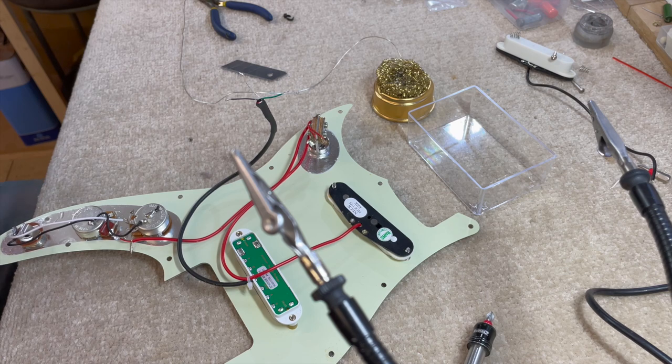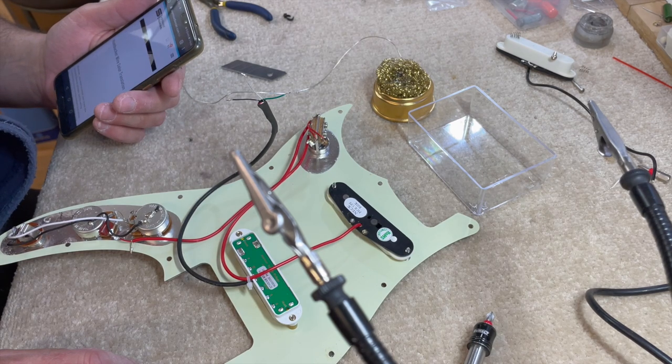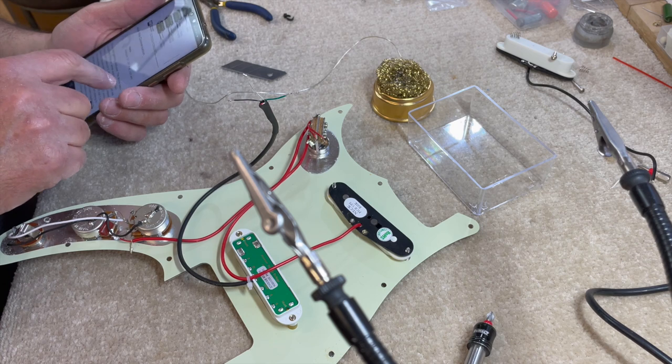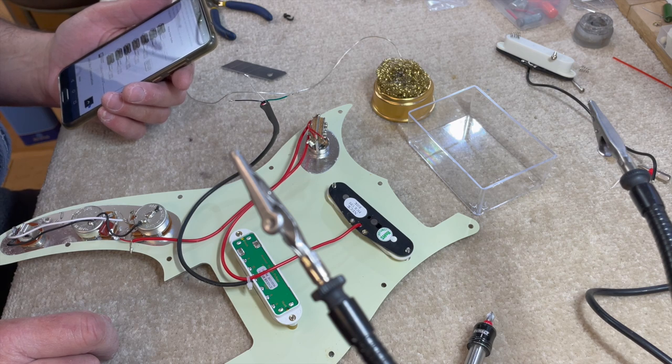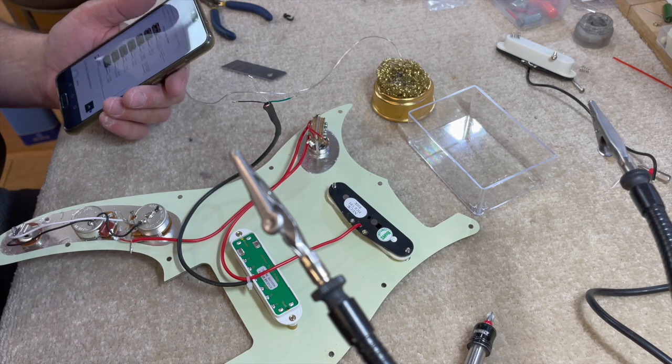Color translation, of course, it probably won't even mention, and certainly won't mention the single coils, will it? So it says we have a Fender: north start, north finish, green, white, white, black, south start. So on the Fender, the coil split pair, if it's a humbucker, is black and white, leaving red and green. Red is the end and the green is the start.